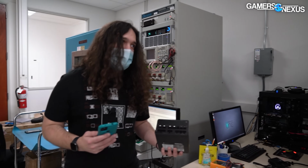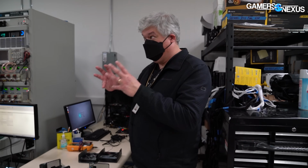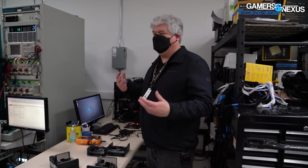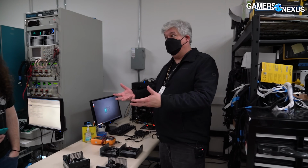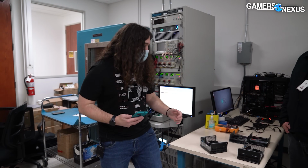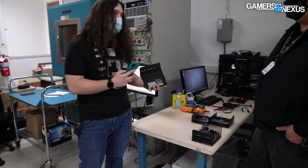Yeah, you can have different pinouts, depending on who the ODM is. If they don't have somebody in-house that says, make this the pinout, then the manufacturer uses whatever their default pinout is. Right. And you can end up with different pinouts for different models within the same brand, not the same manufacturer, but the same brand. Yeah, and just to be clear, the pinout on the motherboard or the component is standardized. The pinout on the back of the power supply is not.